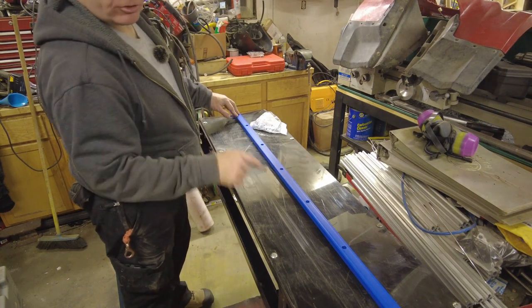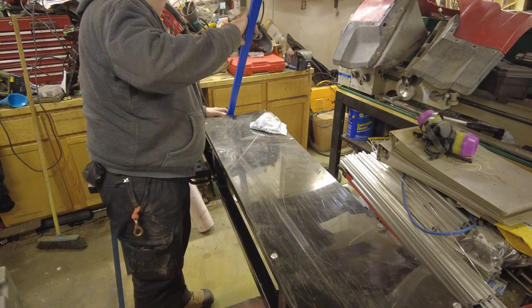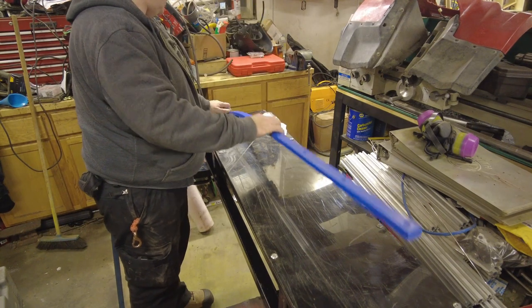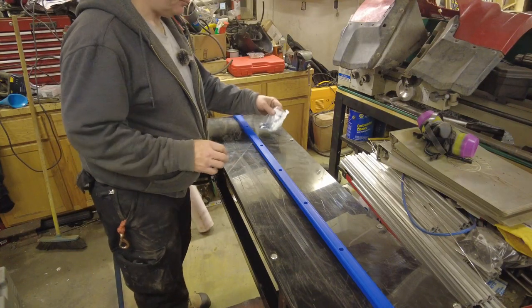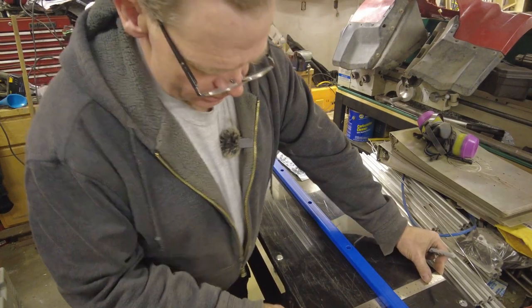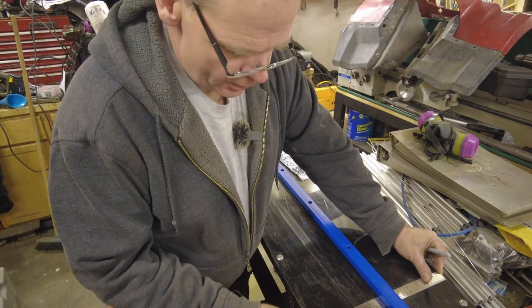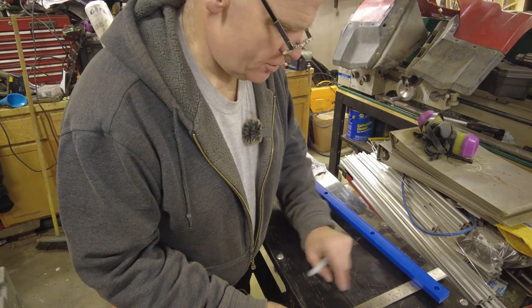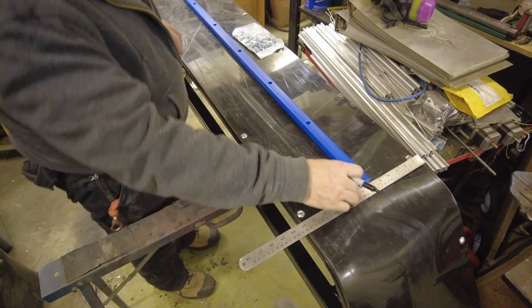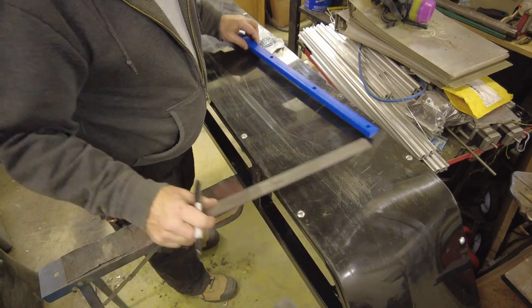I will measure and mark the ski to get it in the middle. We'll start at the front. We'll put some heat onto the Hi-Fax, bend it over, and mount it the rest of the way down. The ski is exactly 13 inches, or the skin is exactly 13 inches, or 33 centimeters wide. So 6.5 inches is the midpoint. And 7 1/16 looks like a good dimension for this side.